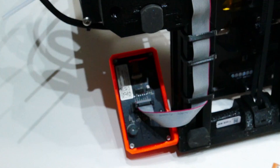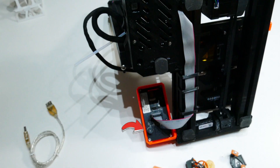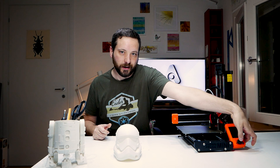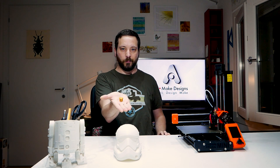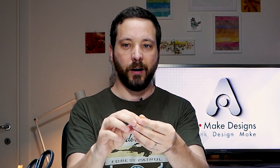The second one is also about the screen. The screen doesn't come with any cover on the back, so the circuit board is exposed. I don't think that's a big risk of getting shorts, but I thought I needed to do something about it. I first thought of designing a full cover, but that's probably not needed. There is a small speaker on the back which is exactly behind the push wheel. So I came up with a very small thumb rest — it just plugs into the speaker and grabs it with four ridges, and you lay your thumb on it while you work the click wheel.